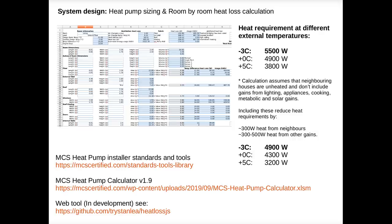If you're interested in doing the calculation for a heat pump system yourself, a good place to start is with the MCS heat pump calculator. This includes a room-by-room heat loss calculator that you can fill out by measuring the dimensions of each room and entering suitable U values. The results give you the maximum heat demand your house will need at the coldest time of the year, and also how much heat each room needs so you can size the radiators or underfloor heating accordingly. An installer following the MCS standard will need to do these calculations, so you can always review and discuss the results with your installer.